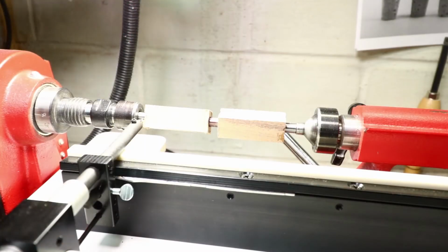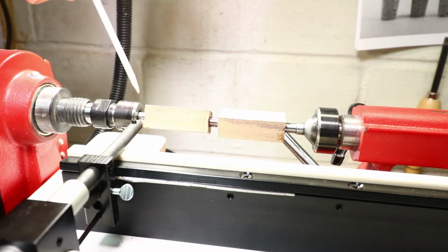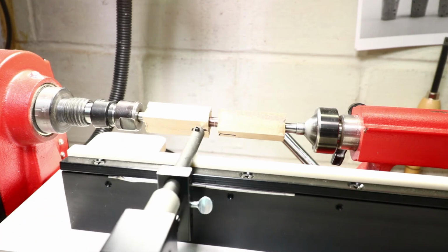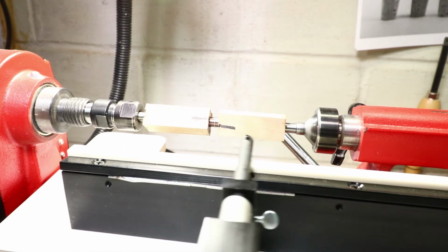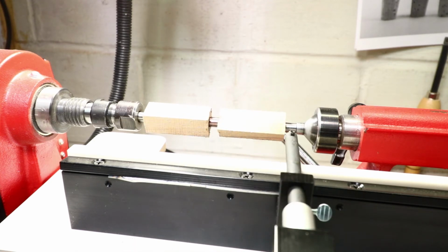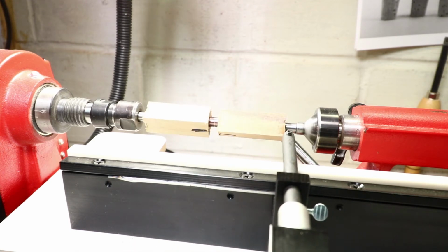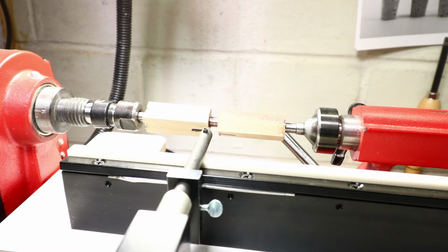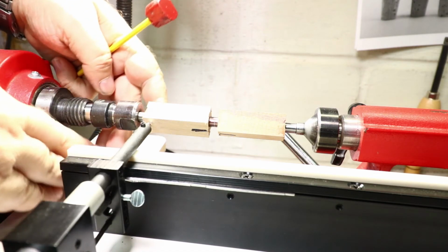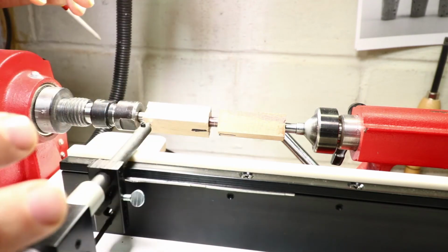Okay, so I made adjustments to get my cutting tip right up close to the bushings here without touching them. So I got that, and then I set that on all 3 of these. There's a scratch on there because of my testing and setting it. And then the last one here, as long as it can spin without touching the cutting tip, I've got good level there. So this is where I had to adjust my horizontal again using these knobs on the table, moving this whole table back and forth.